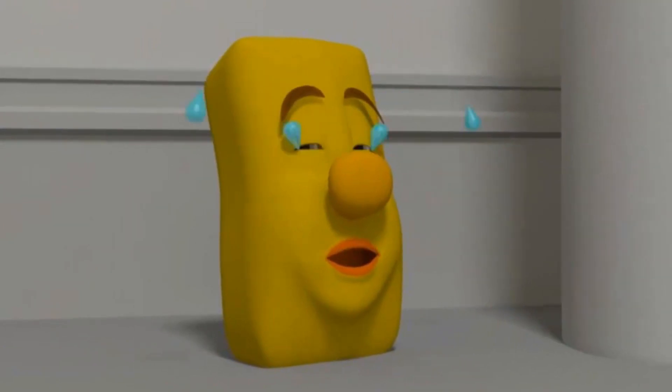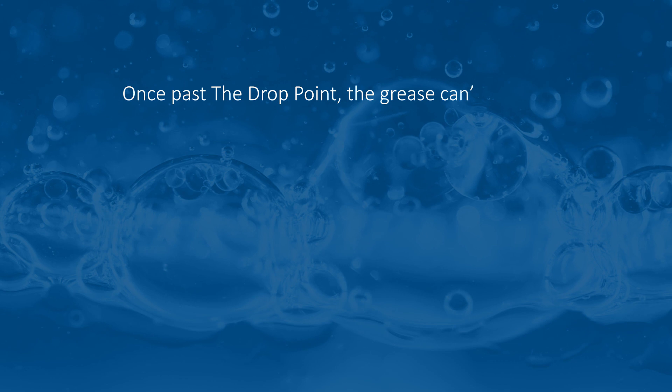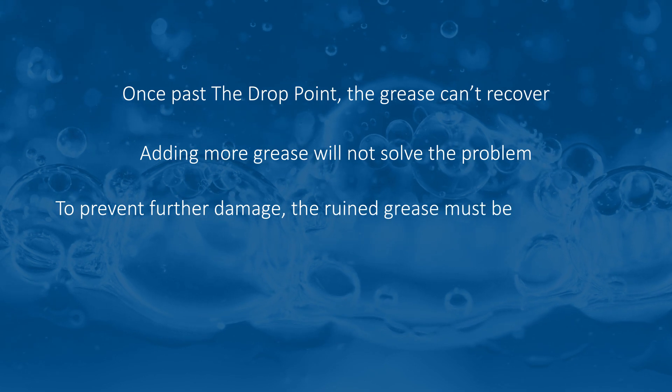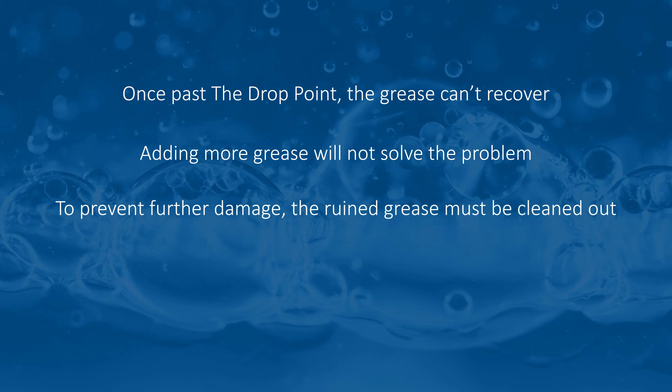It's mainly soap, and you're in trouble — because you can't go around with a syringe of oil and squirt it back in through the grease nipple and expect it to mix up again. No, it doesn't work that way. That's got to come out now and be replaced.